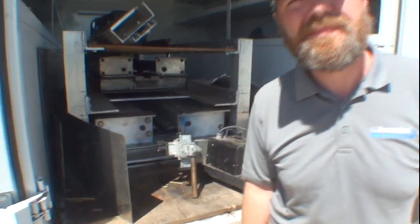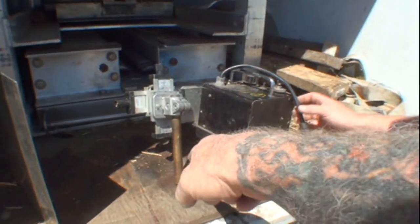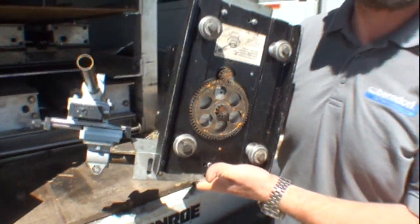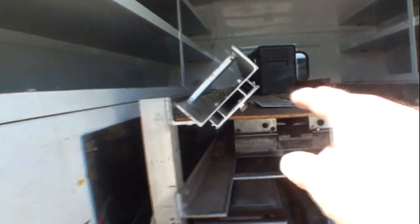So for a three-inch crack — how long does that take from start to finish, perfectly? About three to four hours depending on the repair. Just for a little crack! When doing a full belt weld from one end to the other — five or six feet long — you use the buggo for accuracy. It's gear-driven and slides up on the proprietary track. These little wheels slide right in.